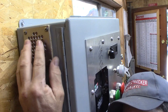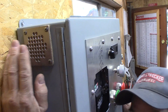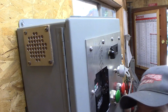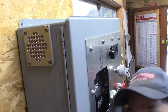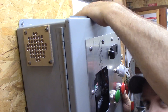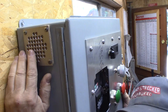It's screwed onto the outside here. This works — I've done this on other panels and it actually works really well. The filter is on the outside, easy to fix, change, and clean. I don't have to open the panel. Having an inlet filter and exhausting air — I like doing it that way. This catches the dirt; you're not drawing dirt into the panel. You're exhausting clean air. It helps keep the panel clean instead of drawing outside air in and pushing it out the top. I don't like open-top panels — dirt and water could get in.